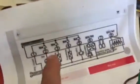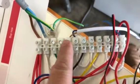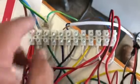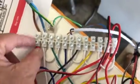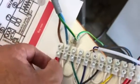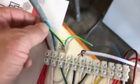So these are my connectors, and I've configured them pretty much like I've done in this drawing. Number one is your public line. This public line is your live. Out of number one, this red wire dips underneath this spaghetti mess and becomes my public line. That public line feeds into the live wire coming out of the socket that's going to run this whole setup — it's going to run my fridge, my dehumidifier, everything. So here's the other side of this line, this is what you're going to plug in.